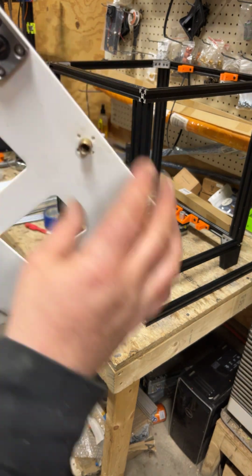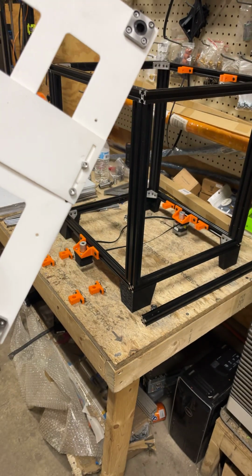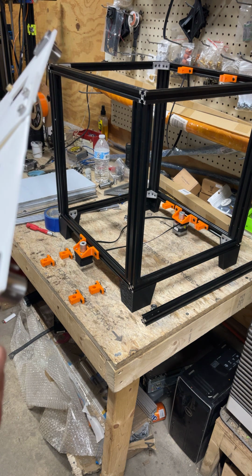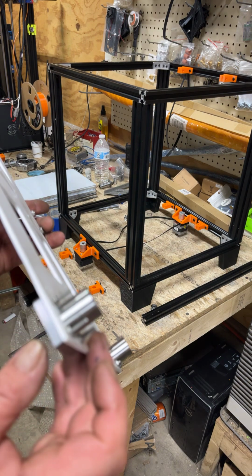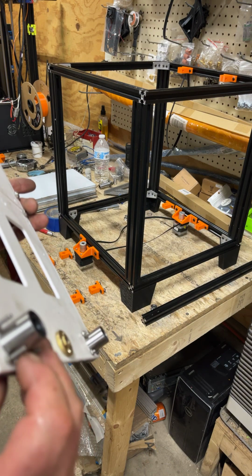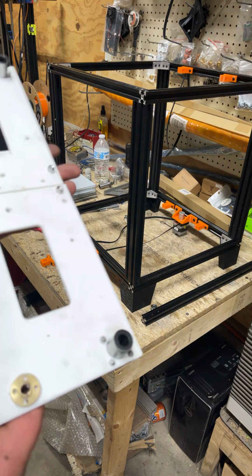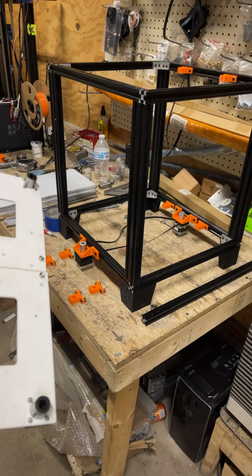And then I left all these bearings just a little bit loose. I used M3 bolts. I think M3 by 8 is what I did for final assembly. M3 by 8 will work, but the basic idea is during final assembly, you don't want a bolt that's longer than this bearing, and you don't really need them as long as what that is. Final assembly, I just kind of had mine like that, but this is just the jig anyway.